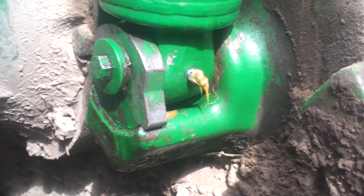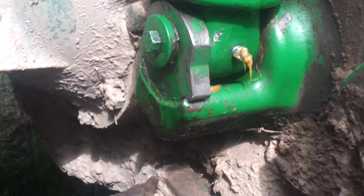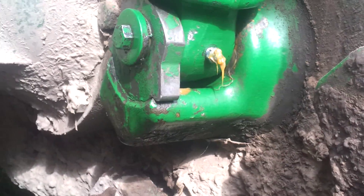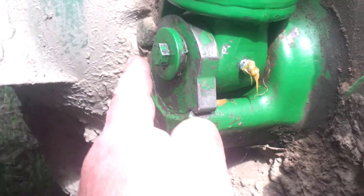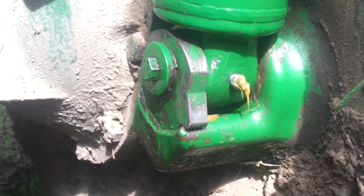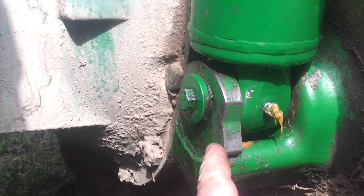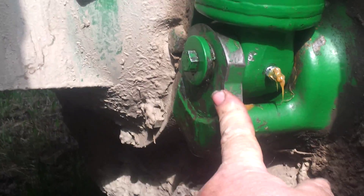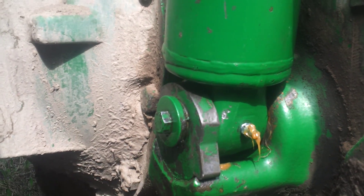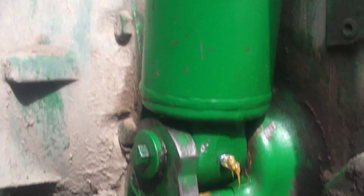At the bottom there's a really nice arrangement — a huge extension to the casting and then this stupid bracket. You take the long bolt out here — it goes right inside the rear axle — and as soon as you take that out, oil starts pissing out. You can take this big washer off, put the bolt back in, and that will slow the oil down. Then you've got to get this off — it's a tight fit on the bottom of the casting, so you've got to try to drive it off to get the cylinder off to work on it.